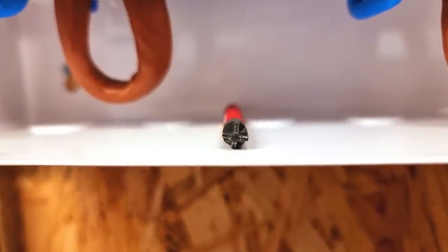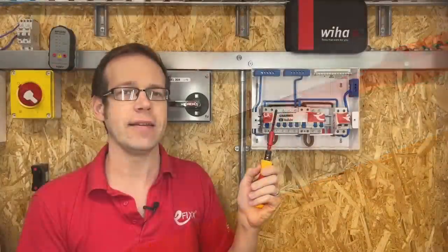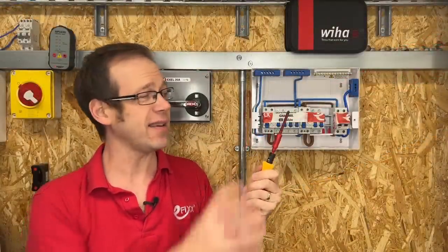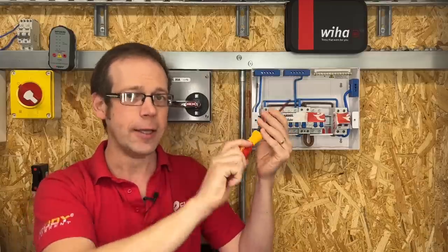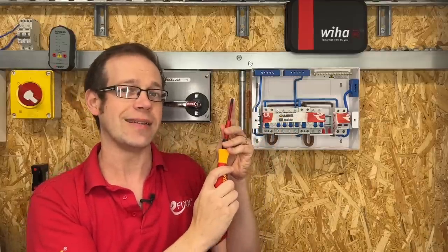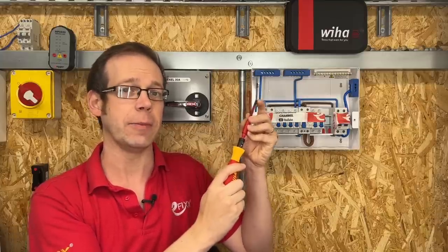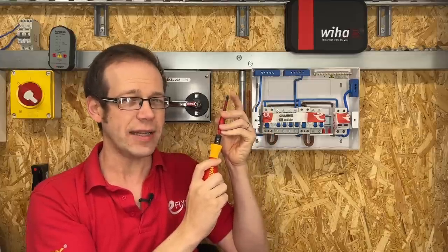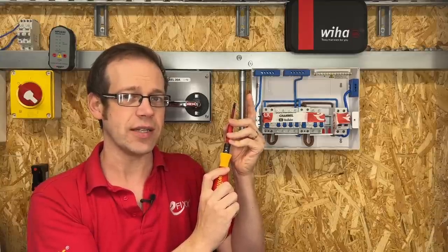So what is the likely cause? Well, it seems to be happening most with slotted posi screwdrivers — the ones that have the posi base shape on the tip with additional little wings on two opposite sides, giving it a flat tip combination. This is an excellent shape of screwdriver tip because it takes the gripping power that a posi tip provides and adds extra turning power via flat tip wings, extending the distance from the centre of the driver head to the outer edge, thus increasing the torque you can apply.